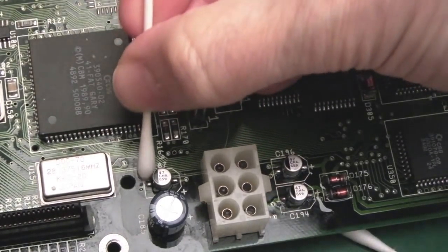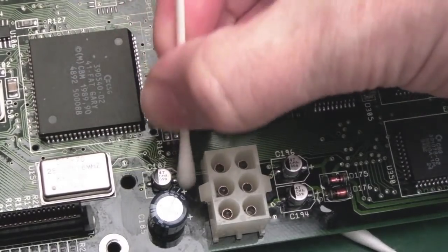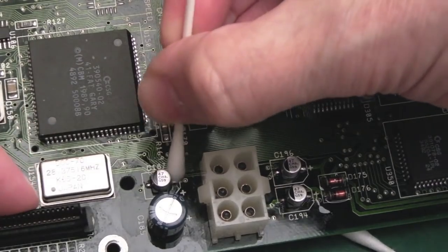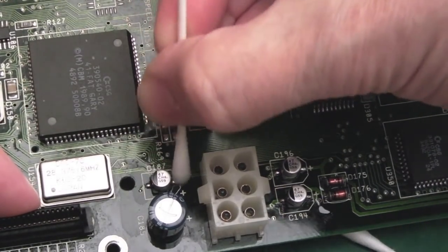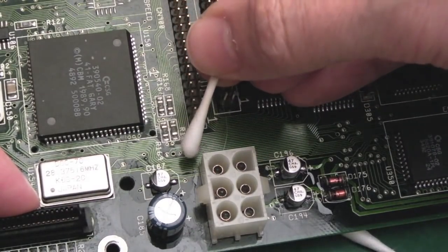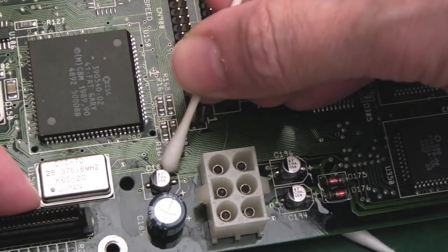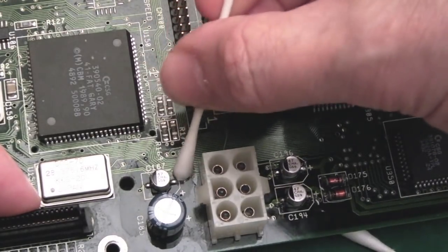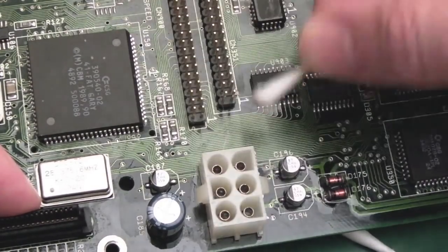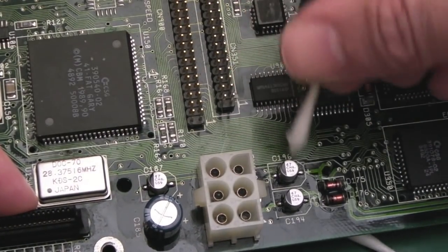So one thing I would say, and this is something I've learned from doing the previous one and moving now onto this one, I didn't need to hold these down. Just make sure it's totally aligned in the centre and that the pads on either side look spaced correctly, as near to the middle as possible, and then bring the soldering iron with the solder very carefully under magnification onto the actual pad, and it flows straight up to the pin. You don't even need to hold the cap down. It took me literally 2 minutes maybe to do all three of those in total. So that's a speed improvement versus the way I've been doing these previously.